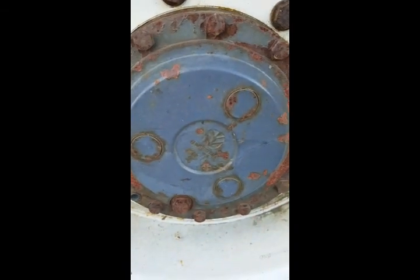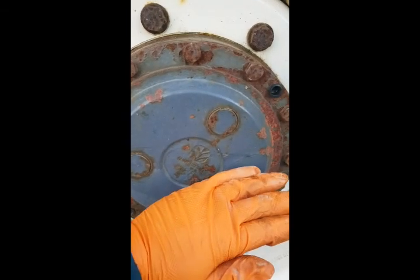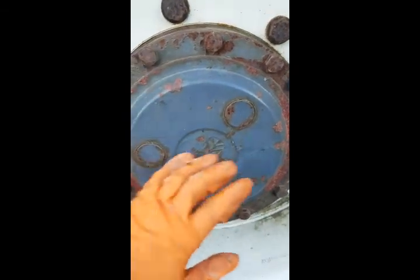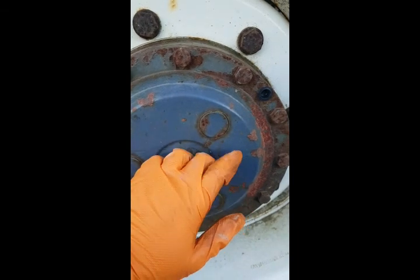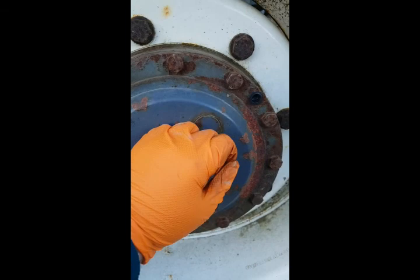That's your level fine. And when checking levels, just see if there's oil in there. You put it at 3 o'clock or 9 o'clock and see if there's any oil again. Sometimes it might not ooze out, but you put a bit of something in there to check there's something in there.